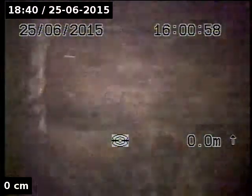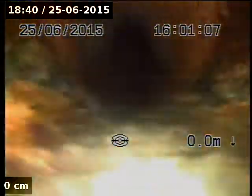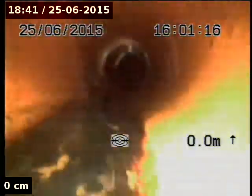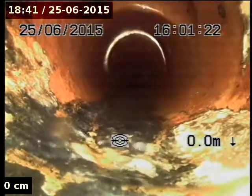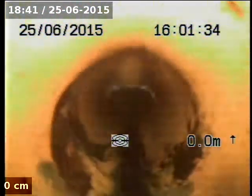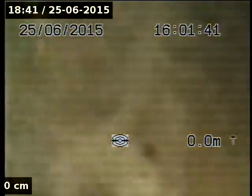We're in the mains there. It's a big pipe. It's in the chamber. Okay, yep, the chamber's out in the street there. Coming back. Little bit of calcified stuff on the side of the pipe. Not too drastic for the distance. Coming back again, joint looks okay. More calcification. Popping back into the trap, but everything seems to be intact.